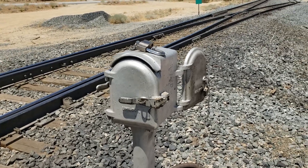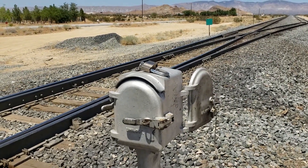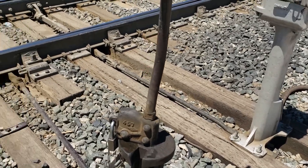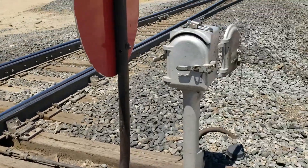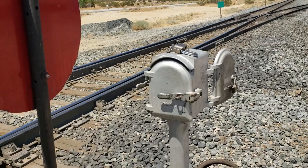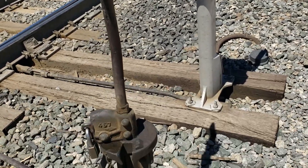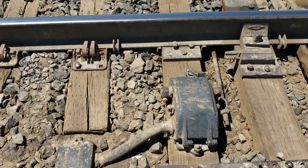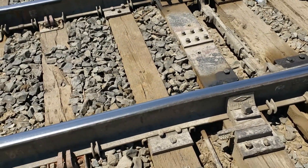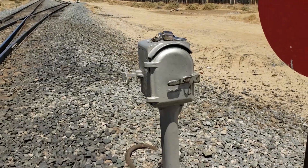Something a little factoid about the SL6: this is made by Union Switch and Signal, which has actually been bought by Ansaldo, I think — they've been bought up by big international railroad conglomerations. But they haven't made an SL6 since 1944 — they're almost impossible to get parts for anymore. But they're very solid pieces of equipment; we've had them in service since the 1920s, I think, when they started making them, and still going strong. As with the other type of hand throw electric lock, this is a switch circuit controller — works exactly the same way. Switch opens more than a quarter of an inch, puts up a track indication, and that is how an SL6 works.